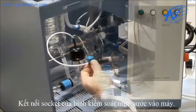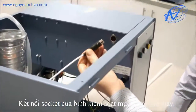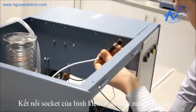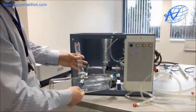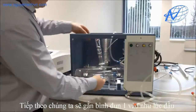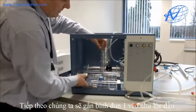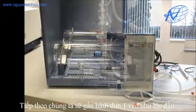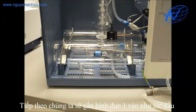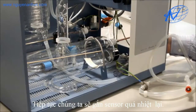Connect our electrical connector from our float switch up to our connector in the chassis. The next thing to do is to refit our front boiler. We put it in place and retain it with our retaining springs. We then refit our thermostat into our boiler.